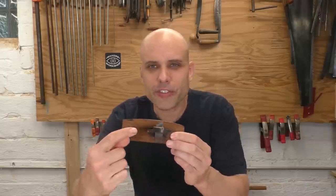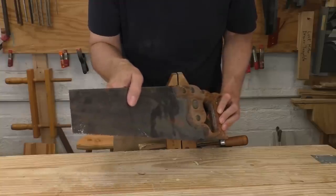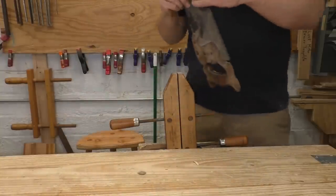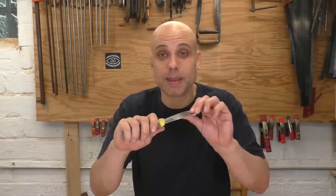This design probably evolved over generations of day-to-day use, and we are not going to mess with it — we're just going to copy it. And the first thing we need is this cutter. But don't worry, you can make one yourself out of stuff you've probably just got laying around your shop. A great material for this blade is steel from an old handsaw. Saws are made from tempered spring steel, so they flex instead of breaking, and they're hard enough to hold an edge but soft enough to cut with common tools. If you don't have an old handsaw, just grab an inexpensive putty knife — that's also made from spring steel. It's going to work great; just grab the thickest one you can find.